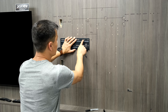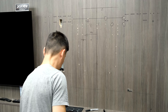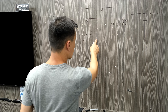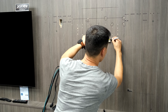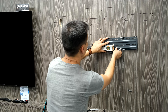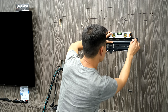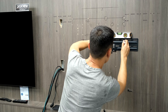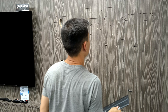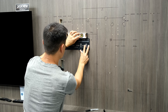So 140mm from the center to that hole, 265mm down from the top — same for the other side, which I've already got the 265mm down. I just need to mark 140mm from the center line to that one. Put that back, spirit level on the top, and I'm going to mark a sufficient number of holes to put some screws in. I'll mark some more anyway — that should do. One, two, three, four, five. Same for this side, spirit level on the top.